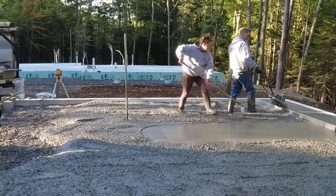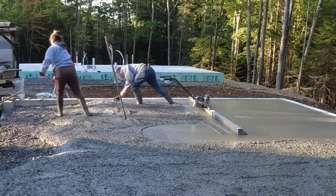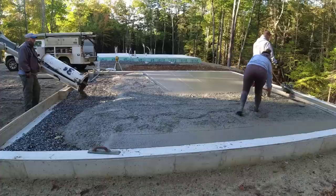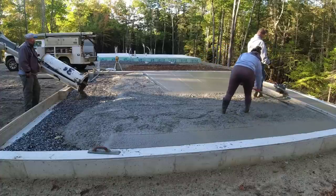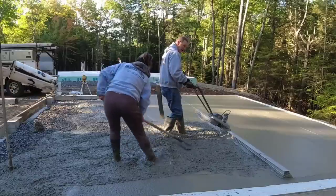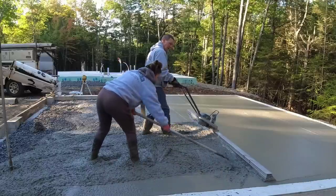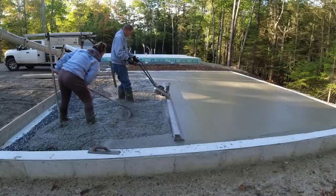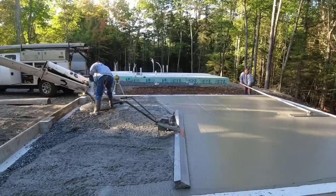That battery screed weighs about 35 pounds and it's really quiet. We've been using it for a couple years now and it works really well. I know some of you guys don't really like power screeds — I didn't at first either. We always screeded everything by hand and I thought it was faster and more accurate, and at first I was right. But after using it over and over again, it's basically just about as fast as hand screeding and just about as accurate for getting the floor flat. It just takes practice and you've got to pour the concrete at the right slump — you can't pour it too stiff.